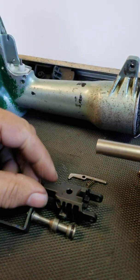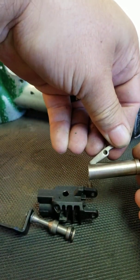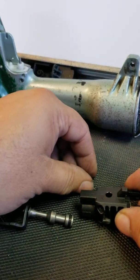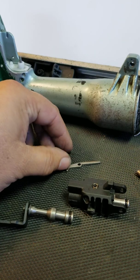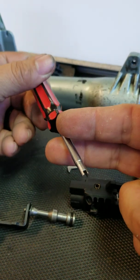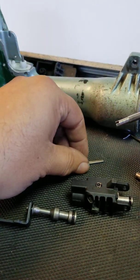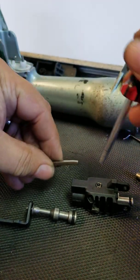To put it back together it's really simple. This slot right here — this arm is going to go in like that on the end once it's put together, so this slot has to go up and down when you put it in. Then we're going to put our spring back in here. What I have here is a Schrader valve tool — you can buy it online. This tool is used on air spring tools to take the Schrader valve out, but the diameter of this shaft is perfect for this, and it has a little slot in here. When you're putting this arm back in, the arm likes to go up into that slot and ride up over the spring, so it makes it a little easier.